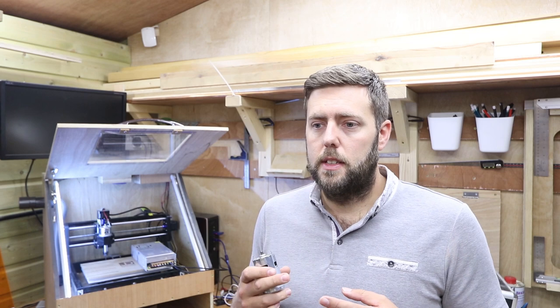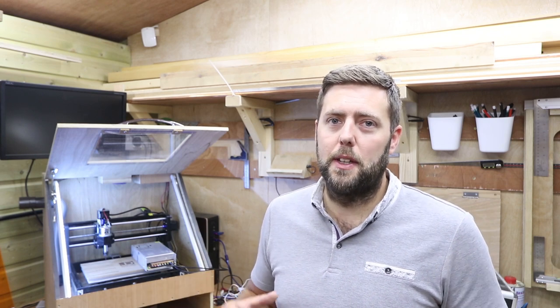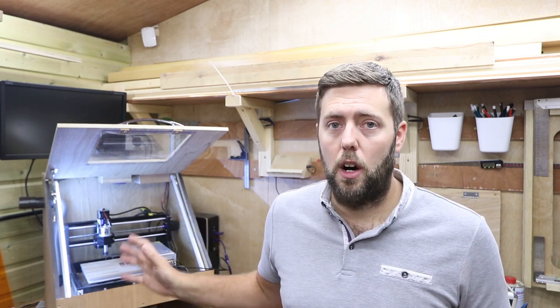There is a workaround: you can buy a motor at a different voltage and wire it up separately with its own power pack, running the spindle independently so you turn it on manually rather than having the control board control it. I'm not a fan of that approach — it's just more work — but that's often what happens when people upgrade to bigger spindles, because the control board can't handle the voltage or the amperage needed to run them.